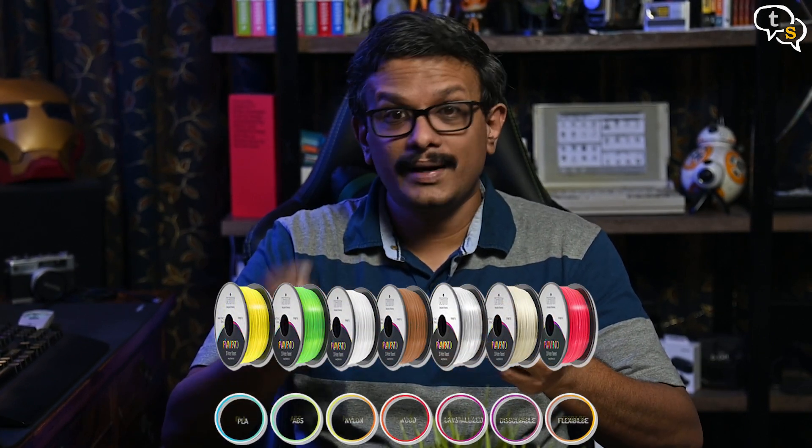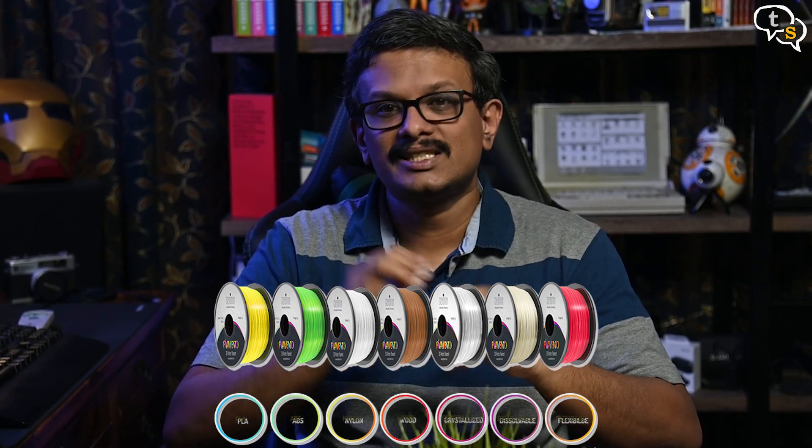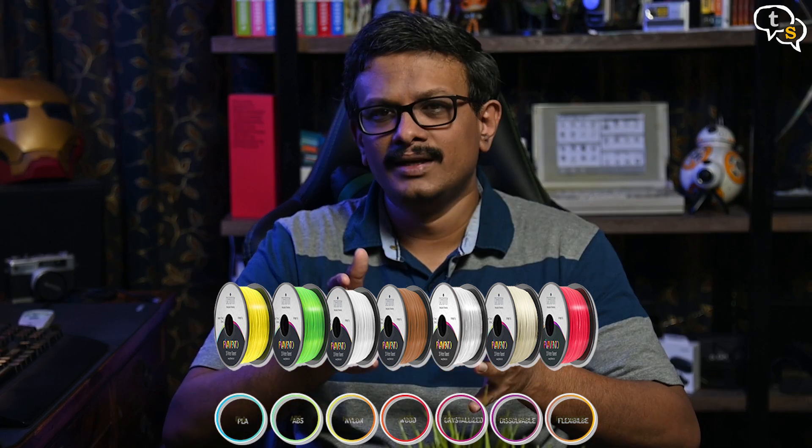Filaments are available in a variety of materials such as PLA, PETG and ABS. Also available are some special mixed plastics that include wood, metal and carbon fiber. ABS material is not recommended to be used in a closed room as it releases toxic fumes, and an enclosure is recommended if printing with ABS.